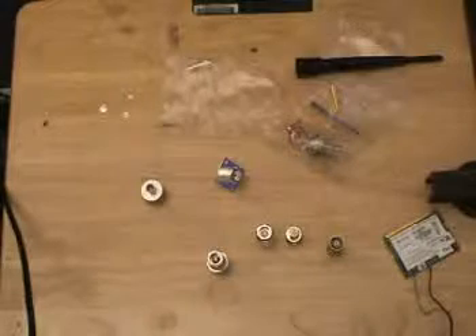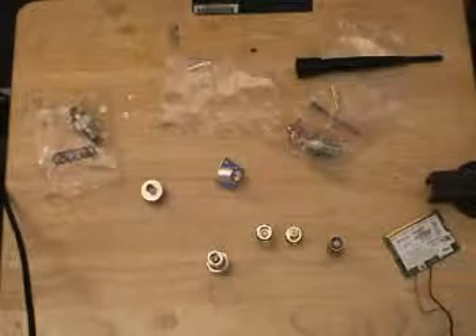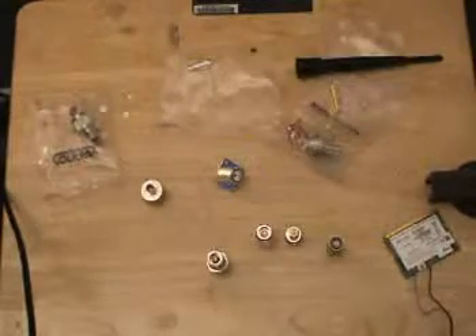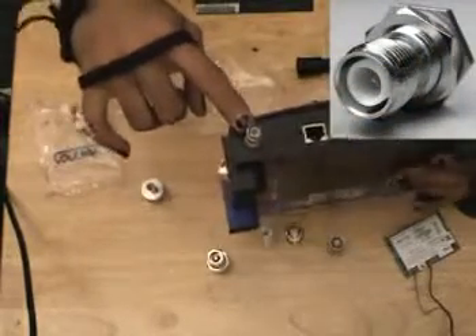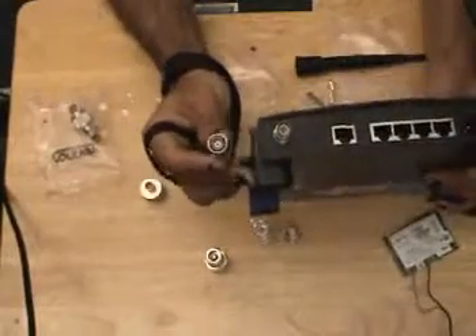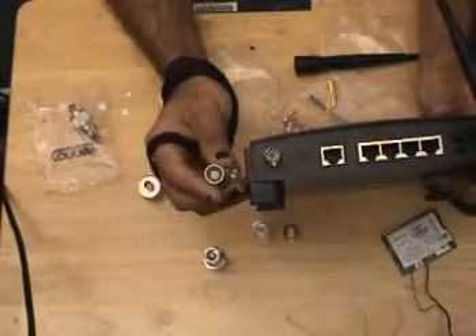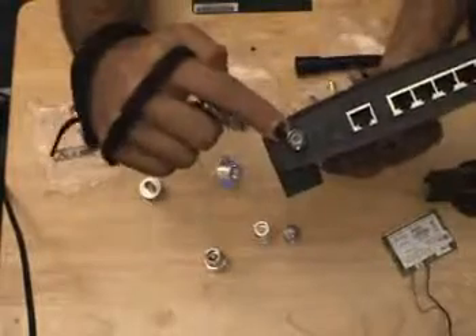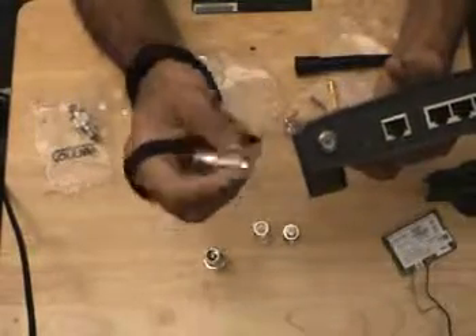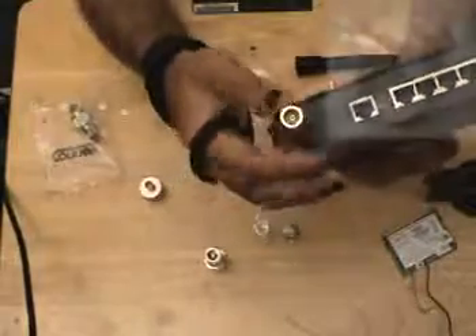I'd like to personally thank Dave and Andre for getting me a lot of these connectors and the coax cable. Here's my Linksys router. My Linksys router has something called an RP-TNC, or reverse polarity TNC. Here's the mating end. This is a reverse polarity TNC — but I don't feel like making custom reverse polarity TNC antenna cables just for this, so I bought an adapter, and this is going to turn it into an N connector.